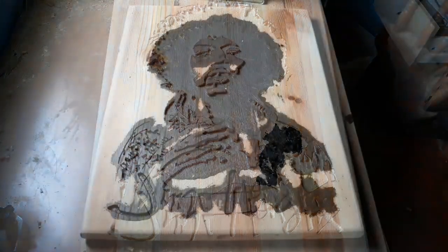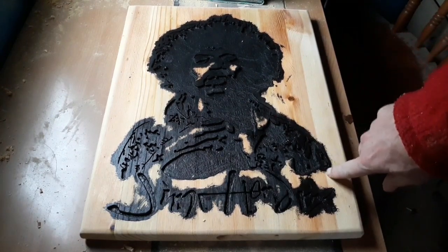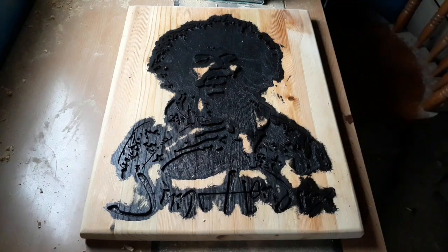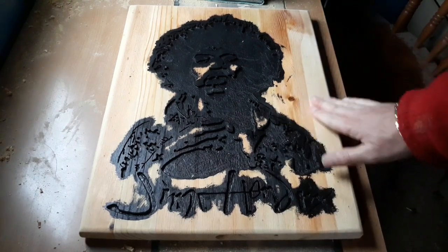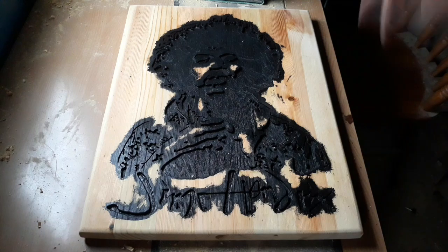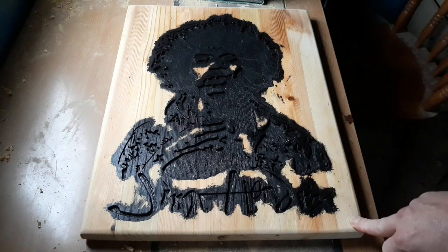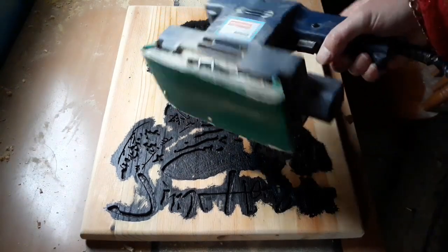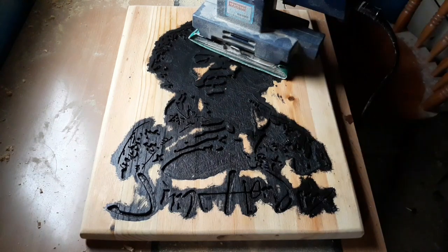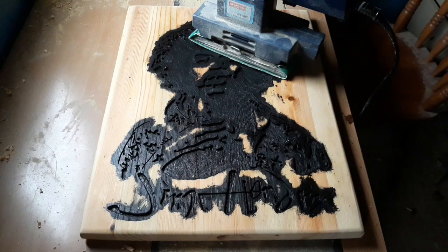We've done our painting — went over it twice because there were quite a few little niggly bits showing. It's all nicely dried now. All we have to do is sand it down and then put a bit of linseed oil over it just to get the wood a little bit darker. You can spray polyurethane, put your varnish on, your lacquer — whatever you're comfortable with. I just tend to put linseed oil on and that's me finished. It's an indoor piece anyway so it doesn't need a lot of protection. I'll use just a basic hand sander with basic papers — a belt sander would be easier but there are quite a few delicate little bits and I think the belt sander would be a little too powerful. So we'll get on sanding this down and see what we've ended up with.